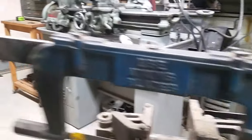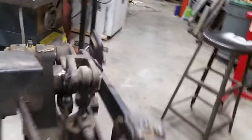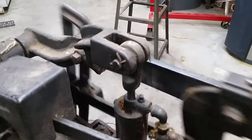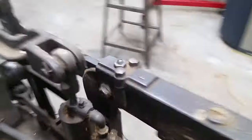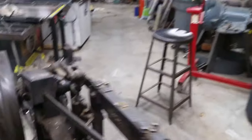You can see the wheel spins and turns this crank, which slides up and down and drives the arm. If you look underneath, you'll see this little lever getting compressed — it goes up and down, and on the return stroke drives this hydraulic cylinder to lift the hacksaw blade on the return stroke. You can adjust the amount of lift right here. Now those seals are all gone, so we're not doing that, but it is interesting.